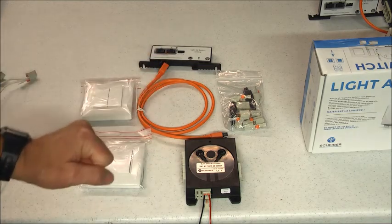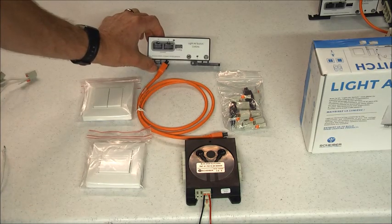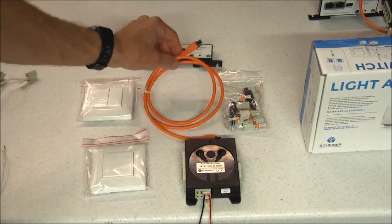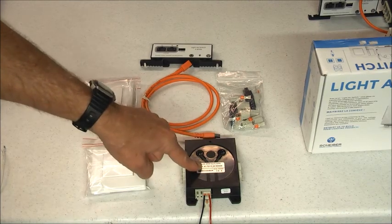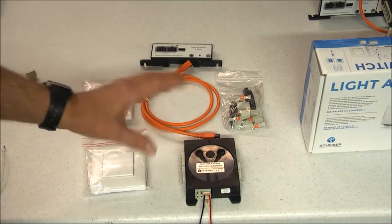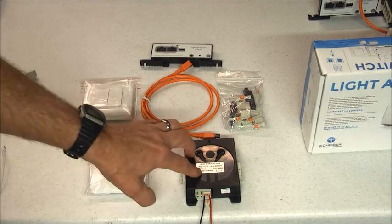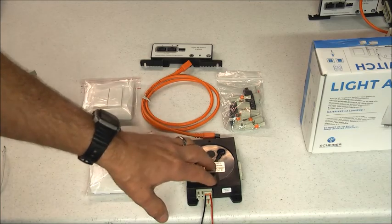I'm going to attempt to program a boat's worth of lights very quickly. What's included in the kit is the receiver module that receives the 2.4 GHz digital signal from the light switches and converts it to a CAN bus signal, which sends it via CAN bus cables — plug and play — to the lighting control module. The lighting control module then actuates and dims all the various lighting circuits. There are no relays; this is all solid state. You don't require an extra DC panel with switches, fuses, or breakers because it's all included in the module.